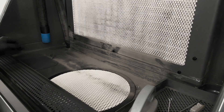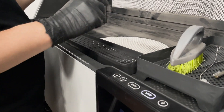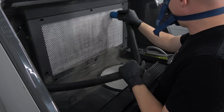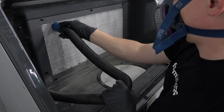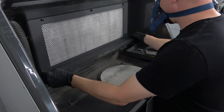Then make sure the Sift is not pulling air through the filter by turning off all other functions of the Sift, including the light bar. Turn on the vacuum and, using the flat end of the vacuum hose, move the vacuum across the surface of the filter in a top-down path. When finished, replace the tool shelf to its position in front of the filter.